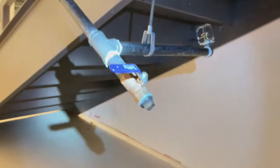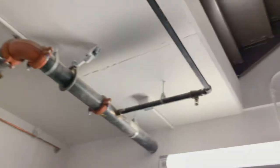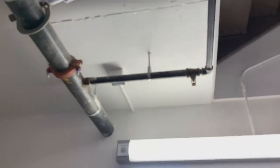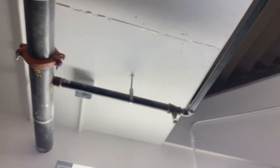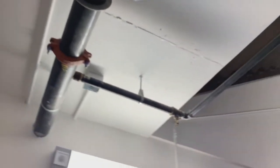And then down here, you have your other fire sprinkler. And a good sprinkler fitter will always put an auxiliary drain valve. Even though there's not a lot of water to be had, you always want to not make a mess when you can, and that valve will solve that problem. So there you go, they got 2-for-1. One I had to drill a mechanical tee, but this one was easy money. If there is such a thing as easy money.